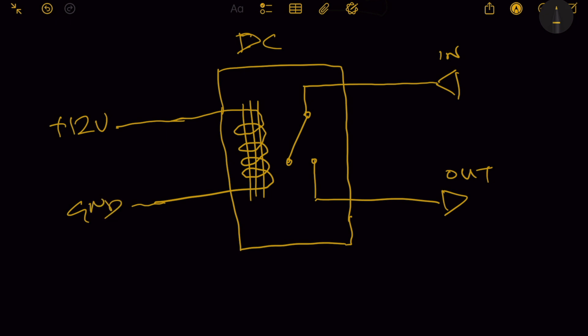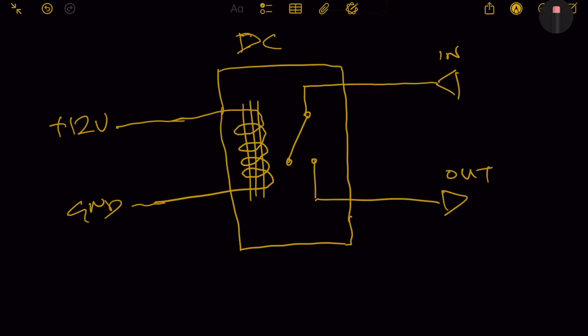Normally you would choose 12 volts if you have a 12V rail in your amp. If your amp has DC heaters, or you're implementing a mod with DC heaters, you can reuse that 12V DC line to power all of your relays. The final thing we need in the circuit is a switch.